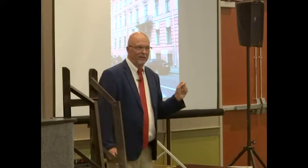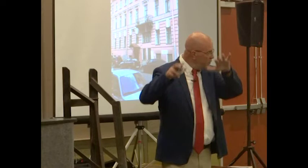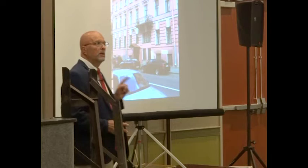So guys, this is graphic. The reason why railings have to have a 200-pound lateral load test is in case you're smoking a butt, drinking a drink, and you're leaning on any rail, it needs 200 pounds of force exerted on it, and that's part of a load test. So 100 pounds per square foot, 200-pound lateral load test on all pieces of the railing. So, just in case you missed it.